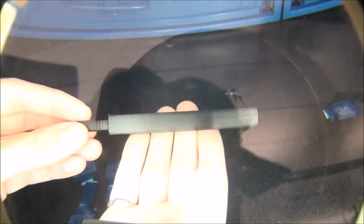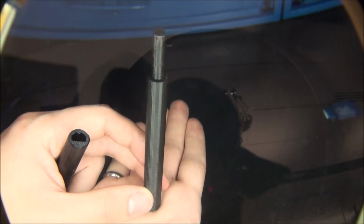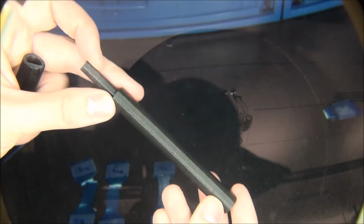Where this comes into play is when you're printing something like a shaft. This is an example from one of the projects we had this quarter. They wanted to print an auger, and I printed it one way and Frank printed it another way. Frank printed his like this. This is the bed, and that's the way he printed it. I printed mine like this. I was going for the shape form, but mine's actually not as effective as far as orientation strengths go for resisting bending and torsion.